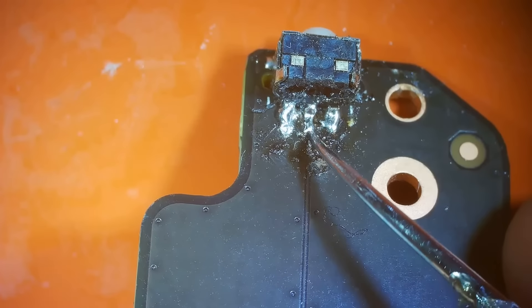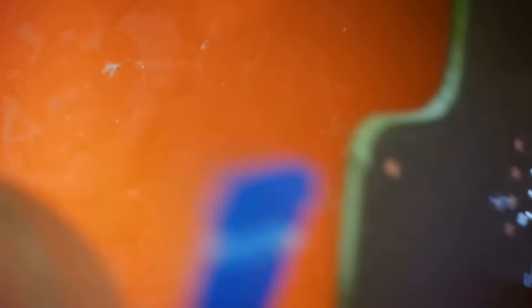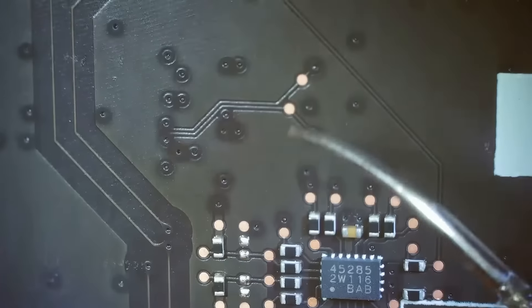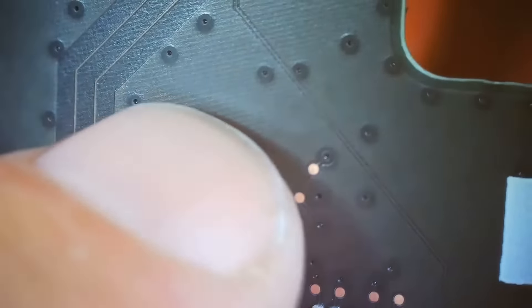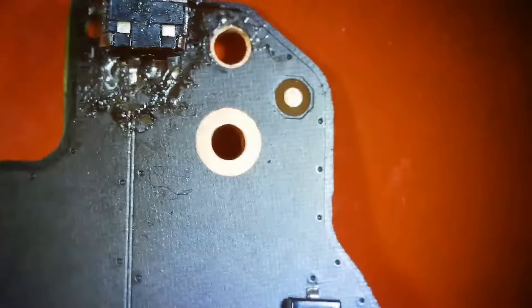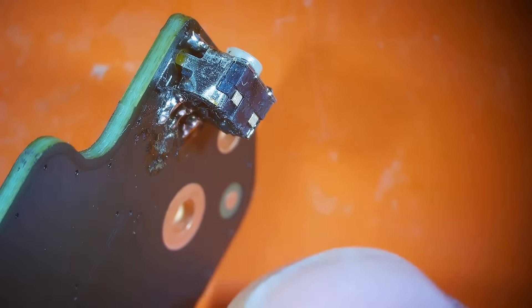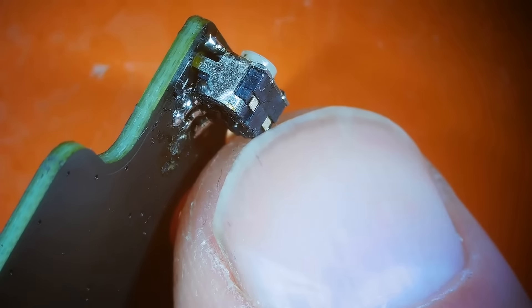Is that the circuit trace right there? I think that's the wire that goes to that middle post — this right here, going down here, down here, to right there. That goes under here to one of these places, which then goes back on top of the board somewhere over here. Either way, I need to remove this so I can really see what we have going on. For this one I'm going to use hot air on the bottom side of the board — that should heat the solder up and let it gently fall off, hopefully without doing any more damage to the contacts or traces.